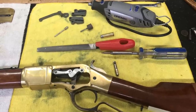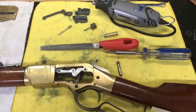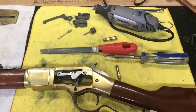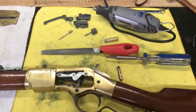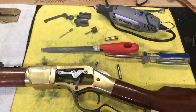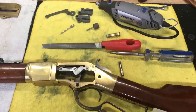If you do not have a gun with a 'W' in front of the serial number, we cannot guarantee — and will not guarantee — that the short stroke kit will install properly. In fact, from experience, 95% of the time it will not. I have had people call and say they were able to finagle it and get it to work, but there's no guarantee. We even give you a liability warning on the website: if you buy this and you have an older gun, we do not recommend you purchase this kit.